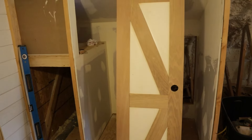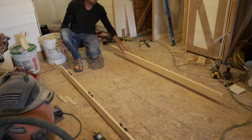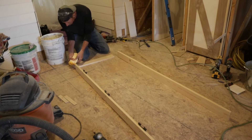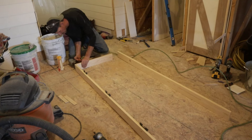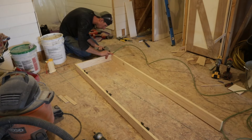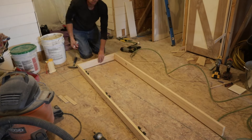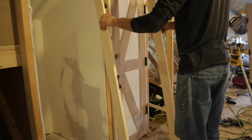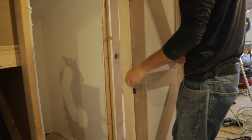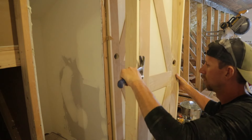This is what the door looked like before paint — kind of nice and cute. I also needed to build custom-sized jambs for the door. I mortised out the other side for the hinges, cut the board to length, cut my top and other side, glued it, and stapled it. Once I had my door jamb done, I did a test fit to make sure the door worked well — it did. I went ahead and installed both doors before moving on to trim or installing the doorstop.